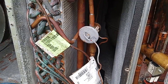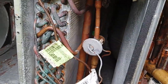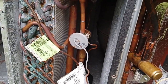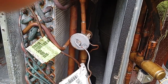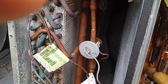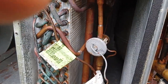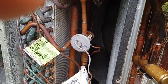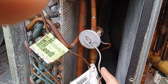That control is not sensing subcool — it can't. My conundrum was trying to figure out what pressures I could put on this capillary bulb just with air pressure to make this system work. This system is rated at about 155 psi with a 70-degree indoor entering air temperature, so 155 pounds on the return side. Could I just put 155 on the top of the diaphragm to put the diaphragm in the center? I have no way of knowing what's happening inside except guessing, and I had no idea what that translates to as far as the valve opening goes.